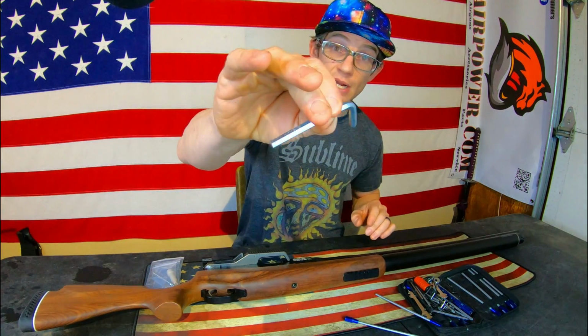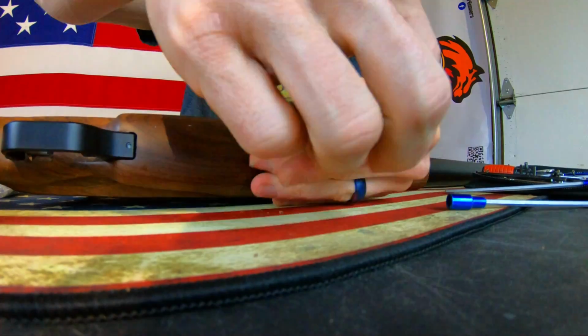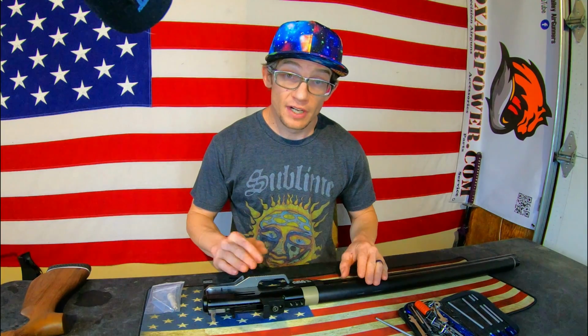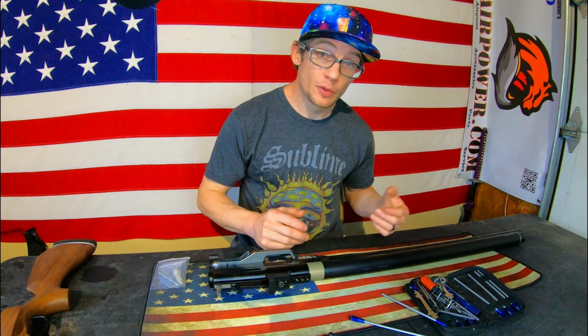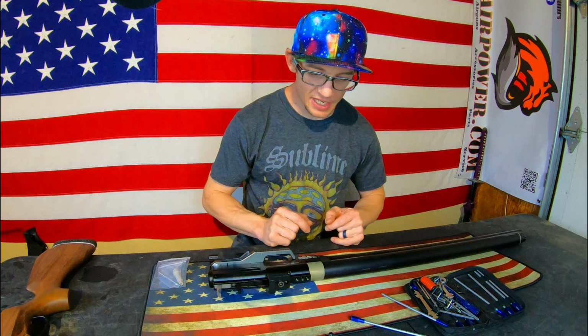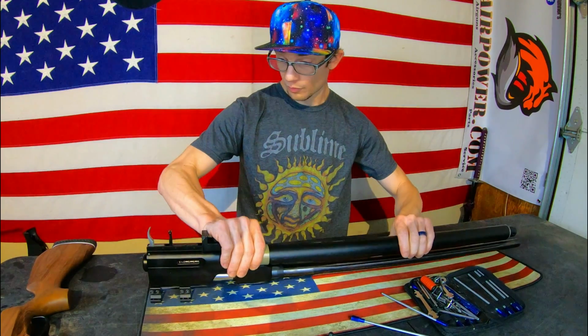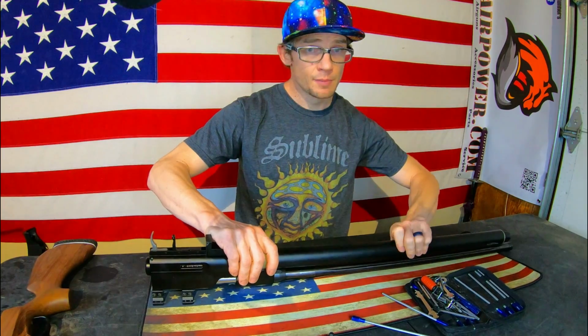It's a 6mm Allen key. I've already verified that this cylinder has absolutely no air in it whatsoever, guaranteed by both the gauge as well as a quick dry fire to completely confirm we're not going to get blasted with any compressed air when we spin this tank off. Comes off real easy by hand. I didn't need any tools.